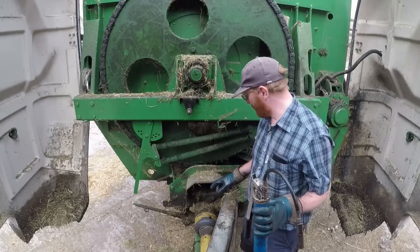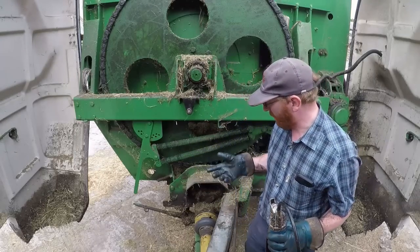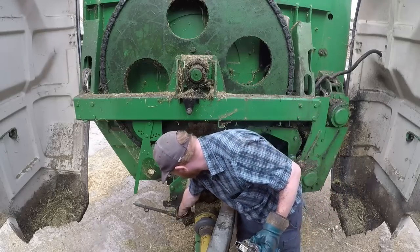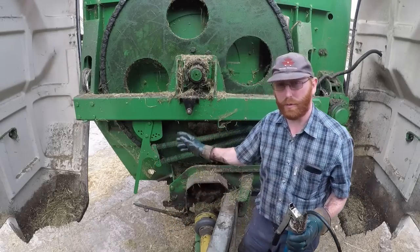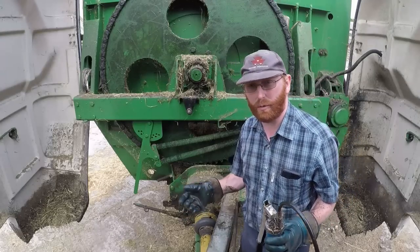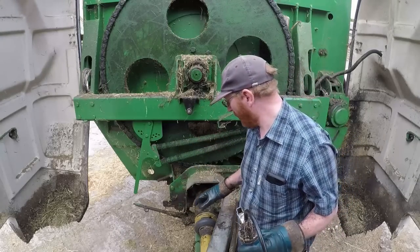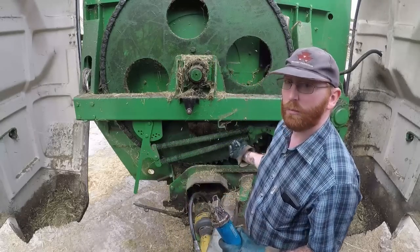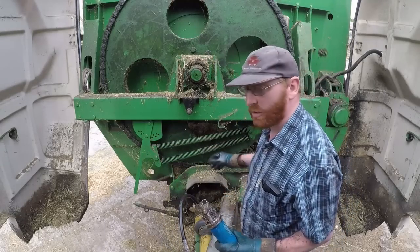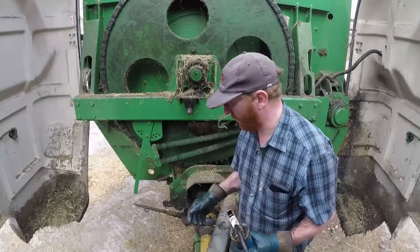So there we go, these two bearings on this shaft, they were remote greasers down here somewhere when it was new, but we've done away with them. We're pumping it straight into the bearing, we know it's getting it, and that's probably what caused the failures, relying on little pipes that we didn't know where it was ending up. So now we just poke about in the back, connect straight to the bearing, and now we know the grease is going where it needs to go.